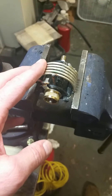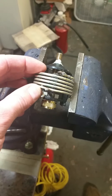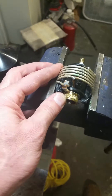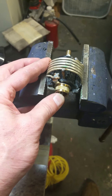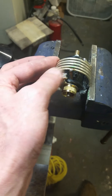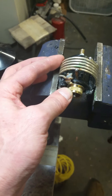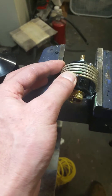With loaded antennas especially, you're not going to have the same situation as a non-loaded antenna. When you check the center conductor here against the outer part where your coax connects — your shielded coax and center conductor — you're going to get a reading because it was connected on this end. You'll get continuity; you might get a resistance reading, basically an open or a dead short right there.